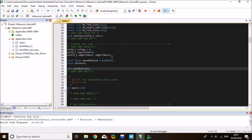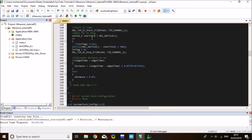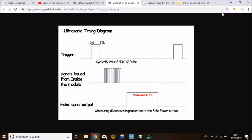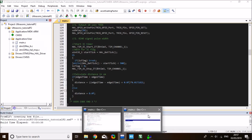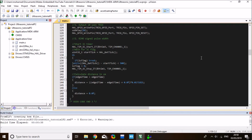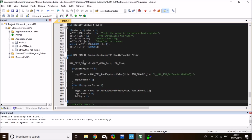All right, perfect. Now, for the input capture, when I start the input capture timer, I need the input capture callback. Whenever this detects a rising edge, it will jump into the callback function in which we can read the ticks. You'll find those down in my preparation code. I'll copy them to my code too, and that is the HAL TIM input capture callback. I'll copy it and I'll explain what it does. Don't worry, I'm going to put the main.c file down in the description of the video, so you can follow along and use the same code I'm using.